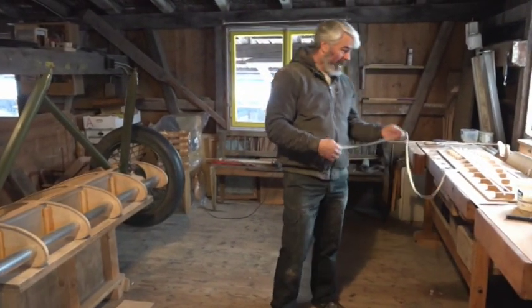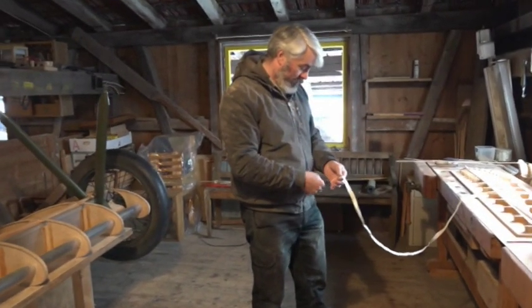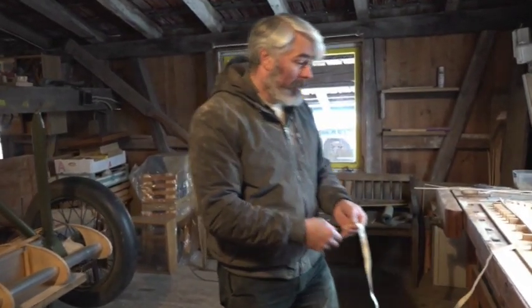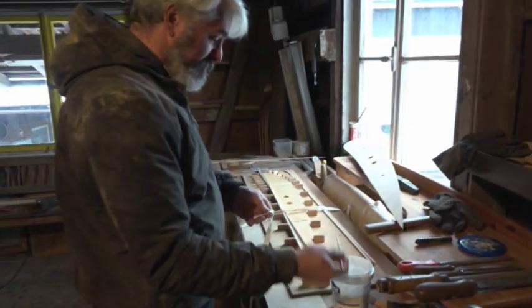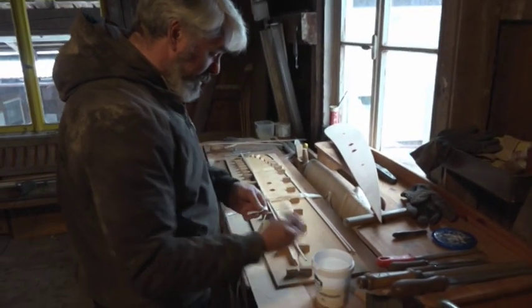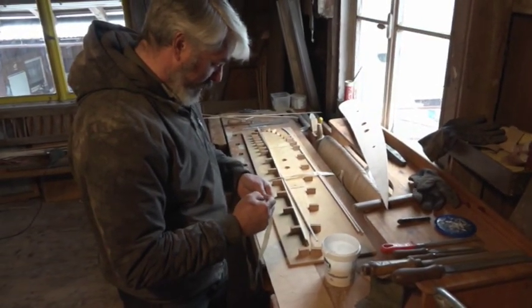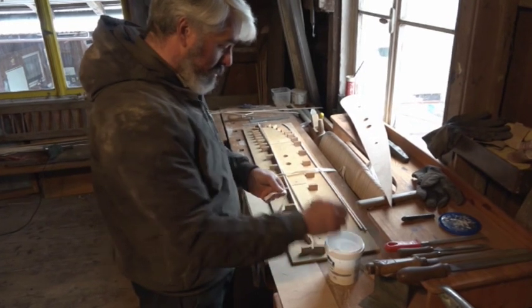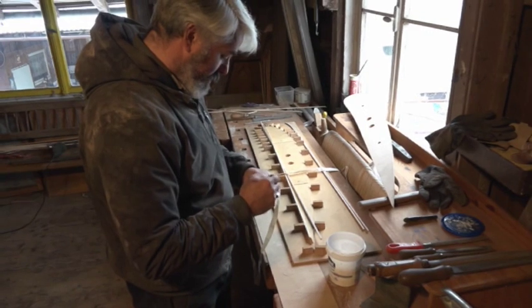Now we do the wrapping of the left-hand side cap strip of the rib, which I have on a roll here. It's a linen tape. Cloth tape, give some glue on the end of the strip to glue it at the beginning. I don't glue it over the entire length of the cap strips because we want to stitch our fabric to the linen wrapping of the cap strip.